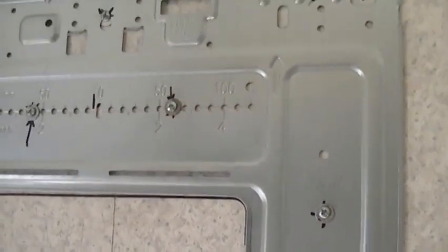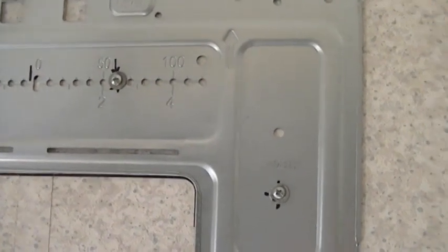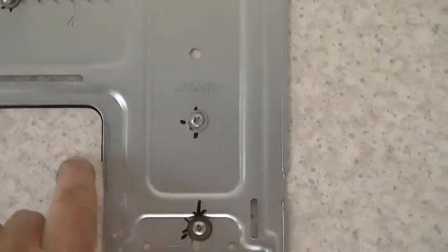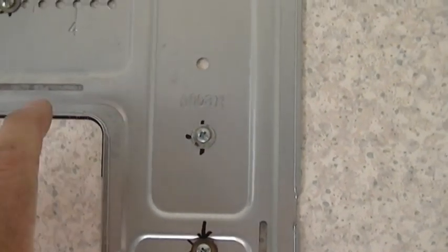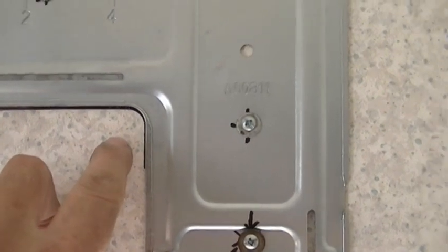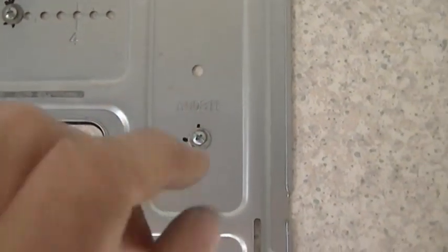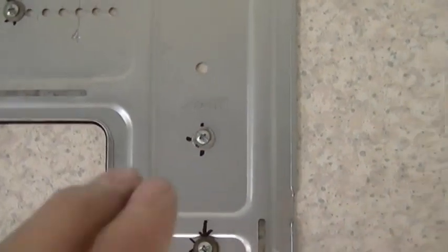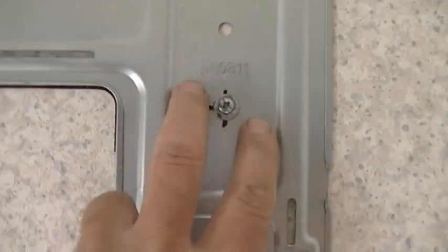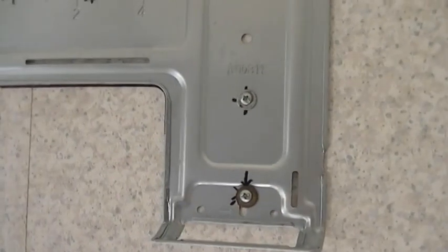Note, when you're drilling the 7/16 bit and all the other drill bits, just drill through the sheeting only. Don't go through the foam. There may be wiring back there, okay? Just drill through the eighth inch panel board only, and the insert will drive into the foam, and if there are any wires back there, it'll just push them aside.